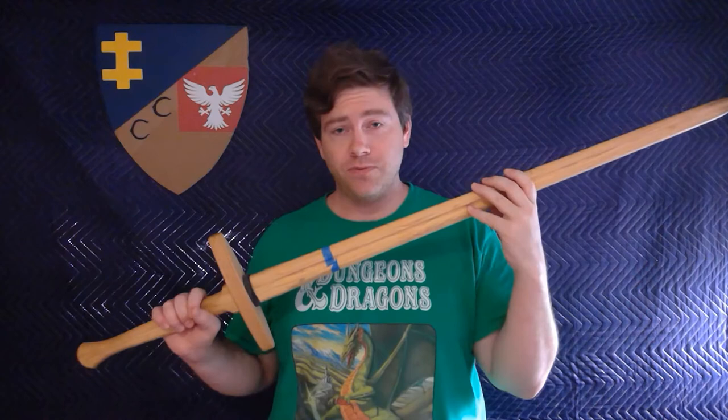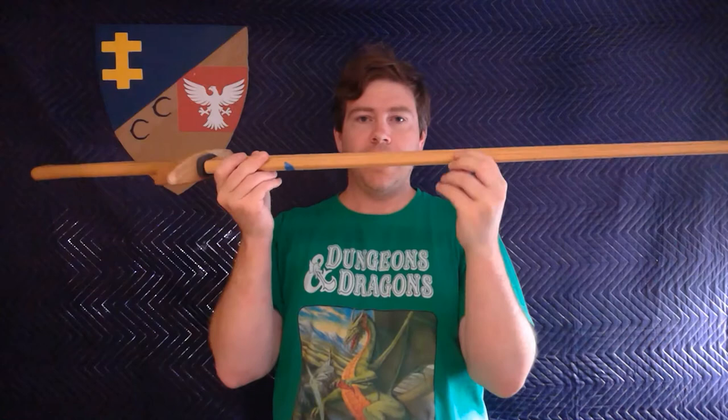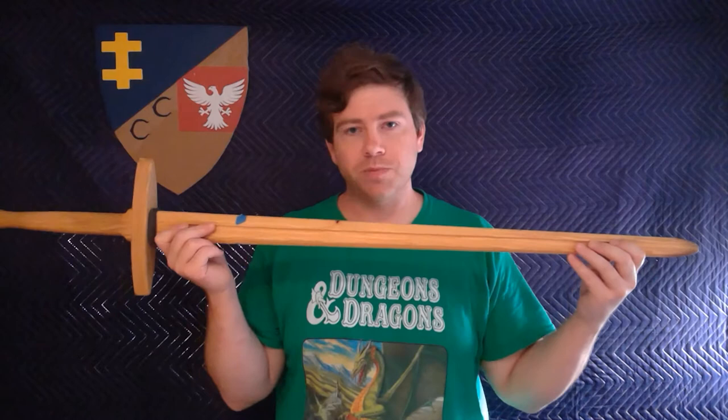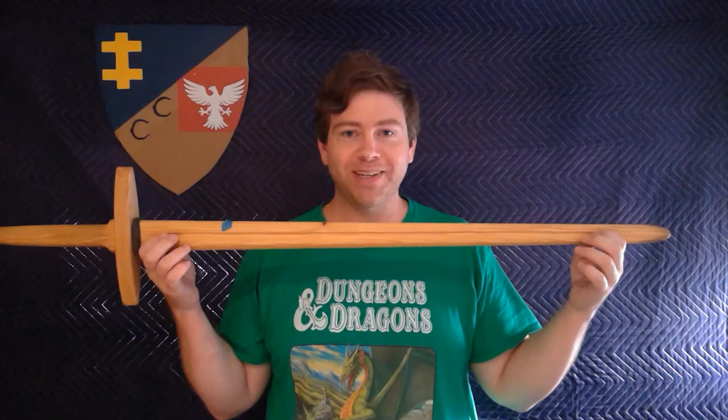So now to get into some of the details of each blade and a couple of small drawbacks as well. Both of these blades are an Oakeshott Type 17 blade, which mostly describes length and cross-section. This actually has a hexagonal cross-section — it's a little hard to see but there's a flat spot on top and it comes to a point at the edges. That's one of the trademarks of the Oakeshott Type 17 blade. It also has a fuller, in this case almost the entire length of the blade, which is not super common but it looks cool so I'm not really complaining.